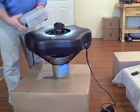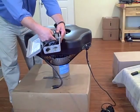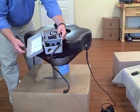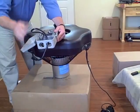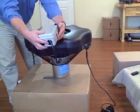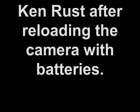The only other tool you'll need is a screwdriver — you can hang this with a deck screw at the pond edge. This is what the inside of the timer looks like. This is your GFI tester, this is for your lights, this is for your unit. 24-hour timer, on and off switch. Red means stop and green means go on these pegs, so you set them wherever you want. You can turn your fountain on and off twice a day if you like. This exits out the bottom of the hole, giving you a nice weatherproof box. Your fountain unit cord comes in through this hole and plugs right into the bottom. Ready to hang on the post, then plug your fountain into this and this into your 120-volt outlet that you supply at the pond bank. You're ready to turn on your fountain and test it.